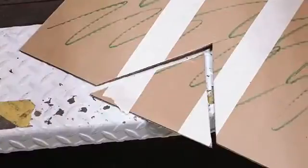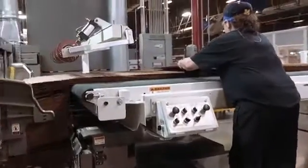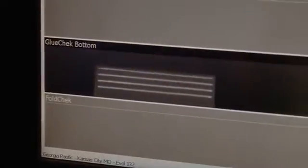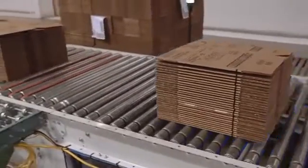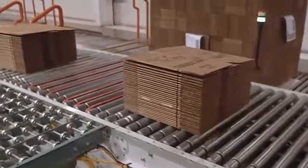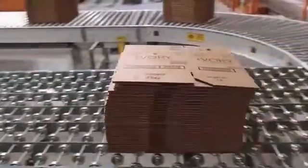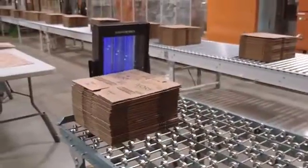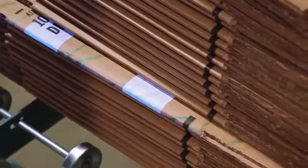These measurements are compared to a developed standard that can predict whether a bad box will be produced as it travels through the machine. Any out-of-spec box that is detected will be sprayed with the UV coating, and the bottom of the bundle will also be sprayed. As the bundle travels down the conveyor system, a black light detects the UV coating and will eject the bundle so that an operator can locate the off-quality box and remove it prior to reaching the customer.